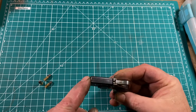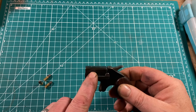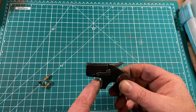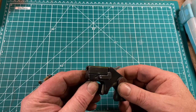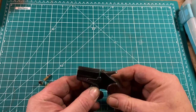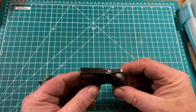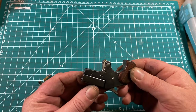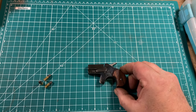The miniature derringer has a section of barrel taken from a cutoff piece of a 10/22 barrel, chambered in 22 short — you cannot force a 22 long rifle into this. It is single action. The internals are 5160 spring steel and the outsides are 1018 mild steel plate. As you can see, it is a fully finished firearm.